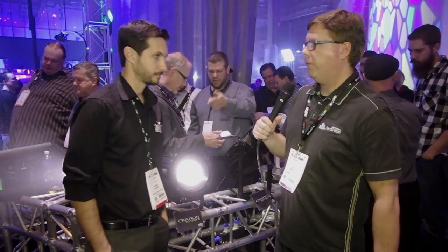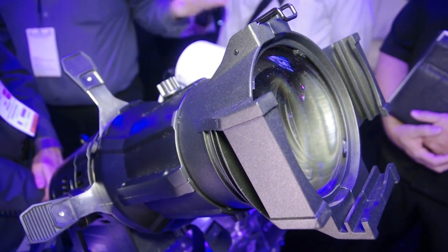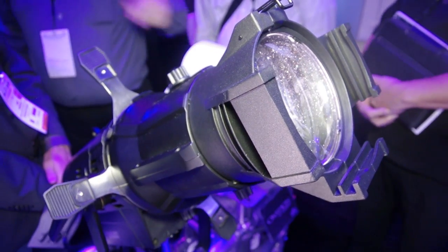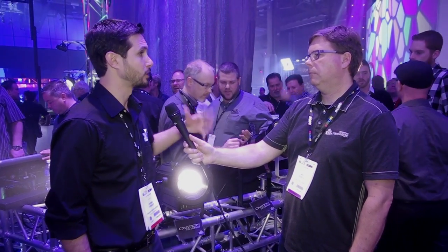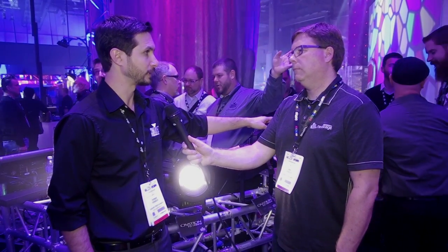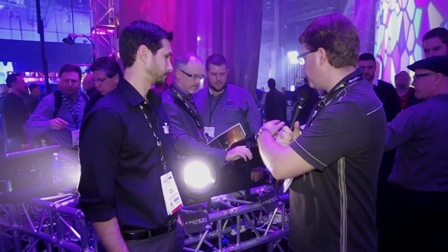The Ovation 190 is basically an LED engine LECO, so if you're familiar with those, you're familiar with this fixture. It's actually very competitive — it's brighter than a standard 575-watt lamp, so it does very well in a theater environment. It has a 3100 Kelvin fixed color temperature. Not only is it extremely bright, but if you already have lenses from your old LECOs, you can swap them — you can buy just the light engine and call it a lamp swap, or buy it with a 19-degree, 26-degree, or 50-degree lens, and they also have zoomable lenses now.